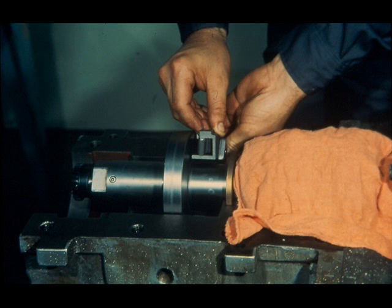A word of caution may be appropriate at this time. If during repair any metal was removed from the face of the lock nut, either face of the thrust collar, or the shaft adjusting shim, you can see that the scribe lines would be meaningless. However, since no metal was removed from any of these faces, the scribe lines will coincide when the nut is properly tightened.